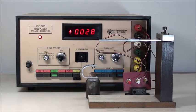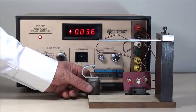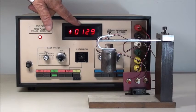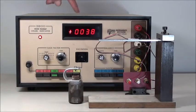When heat is applied to objects, they expand. A strain gauge bonded on a heated beam will see this expansion as strain and will give a corresponding output. If the component is loaded, it deforms and the strain gauge will respond to the load. The reading on the Model 3800 strain indicator will be the total strain due to both load and heating. For stress analysis, the strain due to load alone is important, and the additional strain due to heat constitutes an error.